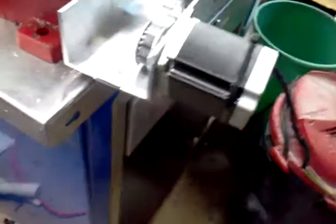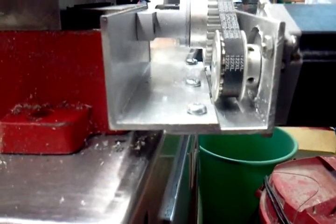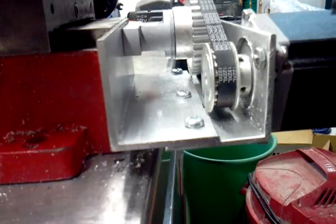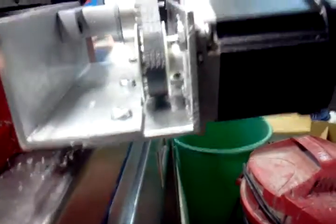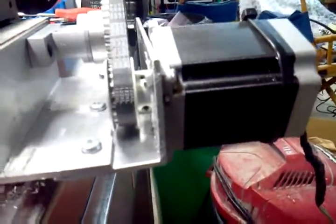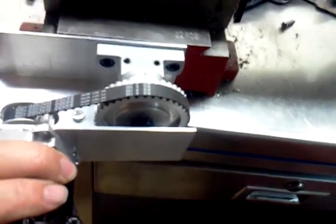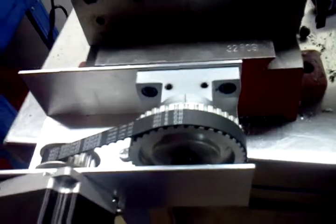Here's my setup for the y-axis. I took two pieces of aluminum angle and used a hole saw to cut a hole in one end to fit the little shoulder that's on the stepper motors — there's a shoulder about the width of that pulley to bring it flush. Then I just drilled holes and bolted the two pieces together. It gives a very rigid mount: no flex in the direction of torque, just a little bit up and down, but there's no force that way.